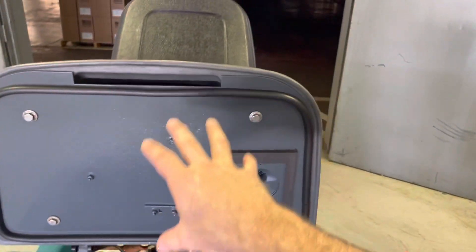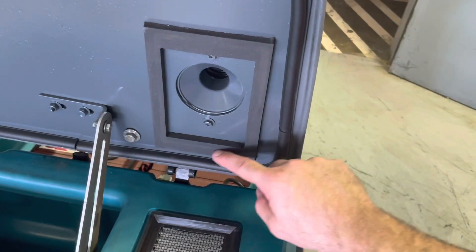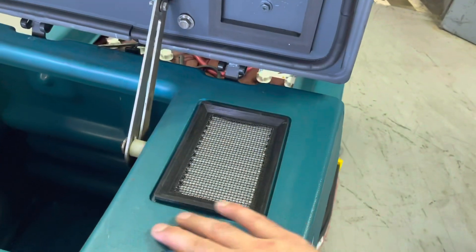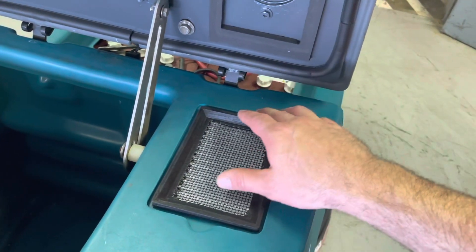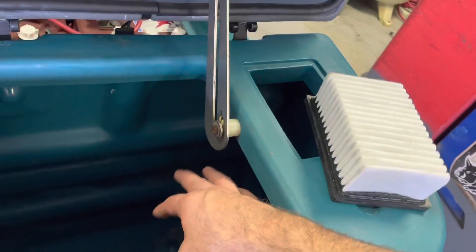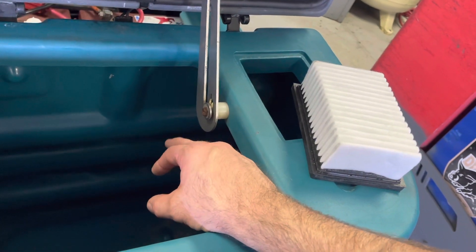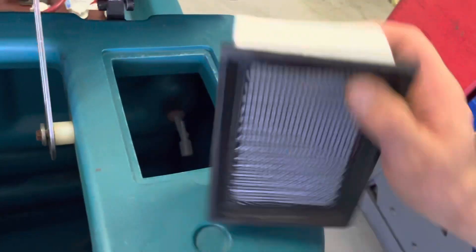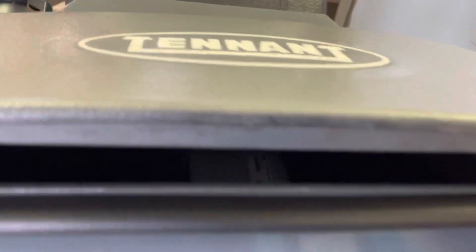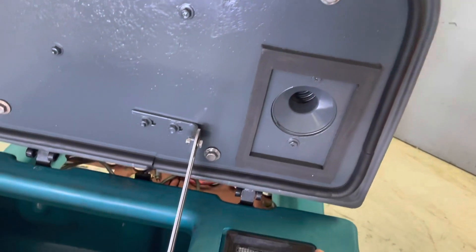The vac motor is located inside the housing on top of the recovery tank. There's a small gasket around the vac motor inlet that's only to keep trash from entering the vac motor. This filter, likewise, stops any floating debris or early dust before water's in the path from being sucked up into the vac motor, which has several lightweight impellers that can be thrown off balance and bearings that can be damaged as it takes on trash.